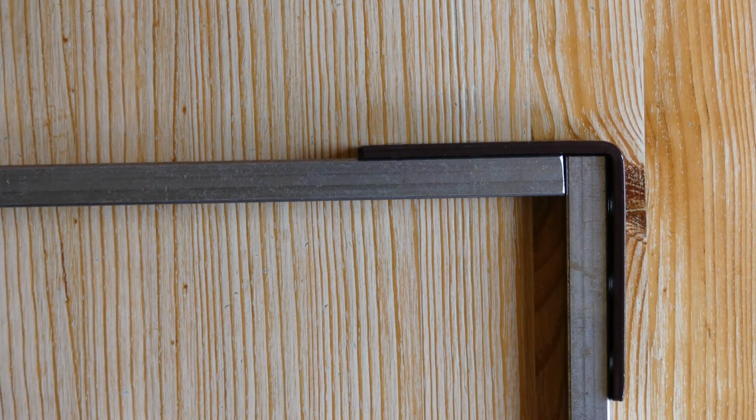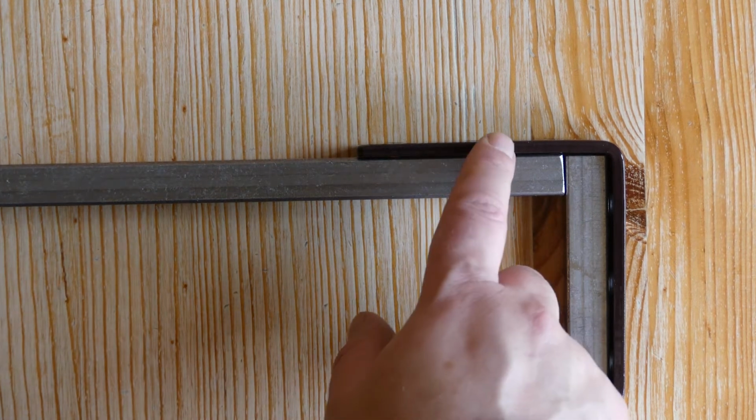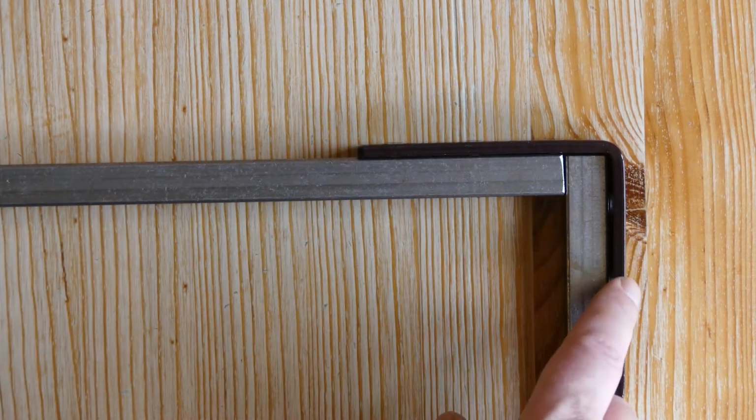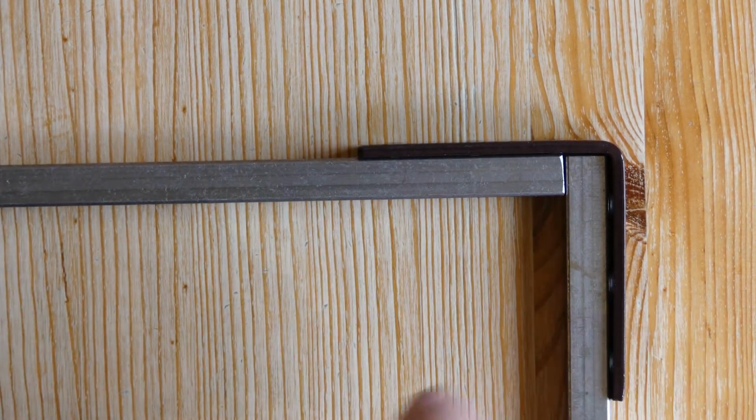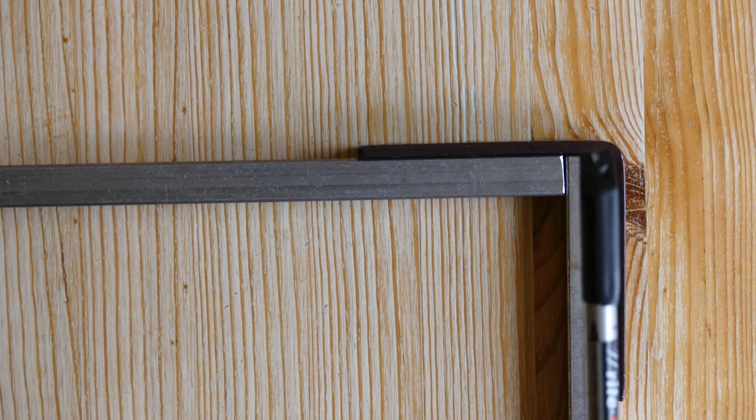So what we're going to do now is we're going to make the mounting frame. So we're going to take this angle bracket and we're going to drill 2 holes here and here, 2 holes here and here, and we're going to bolt those, and we're going to pop a locking nut on the end and make that nice and secure. And obviously we're making a U-frame, so we'll do that on both sides.